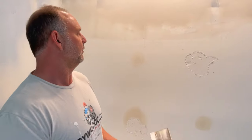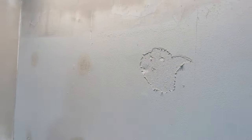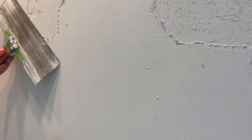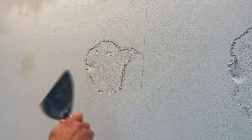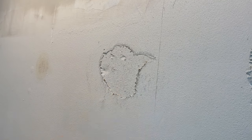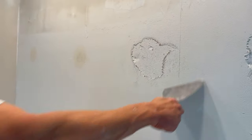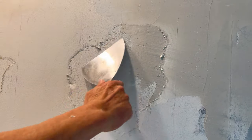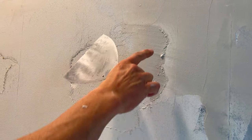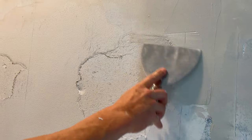So you can see all the trash on the wall and stuff like that. You can rub it, get some of it off, but we just take a knife and scrape over it. Knock any of the, what we call tits in the industry. Knock any of the high places down. So that way when you mud over it, they don't come off in your mud like that right there before it was scraped. You can see what it does. It's hot mud, so it's no big deal. You can wipe it back down, but